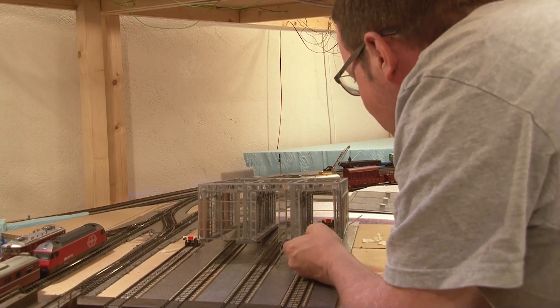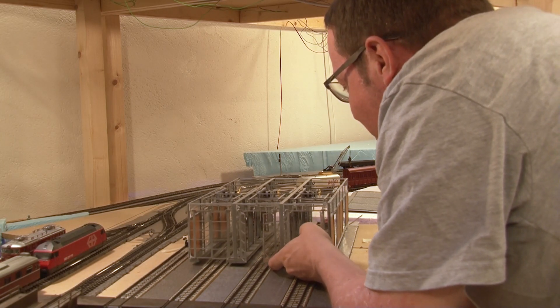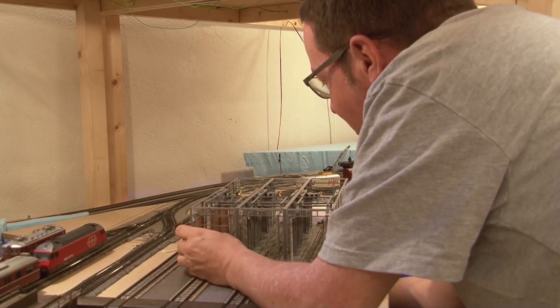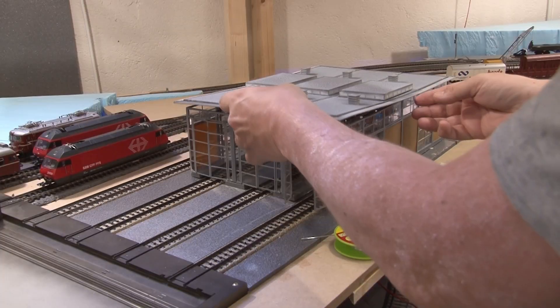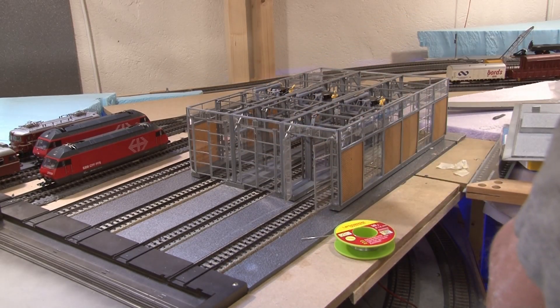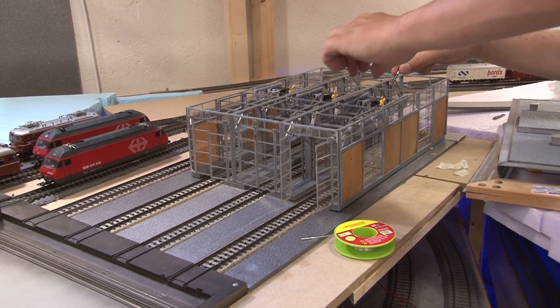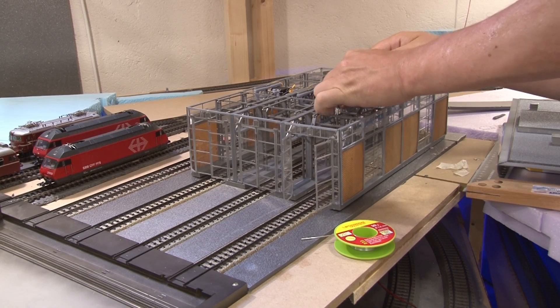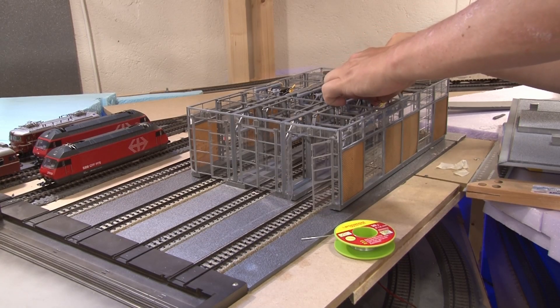Because the thin wires run directly underneath, you have to be careful not to destroy them — which actually happened to one of them, so I had to solder an emergency piece of wire. Then I have an ASU switch below the servo under the plate. After that it was just a matter of connecting everything and programming the servo so the door opens and closes properly. If your values are out of range the servo might pull the cable into a bad position, so you'll have to open it and put it back manually — but if you do it patiently step by step, that shouldn't happen.